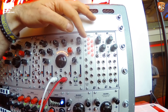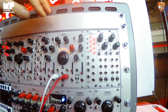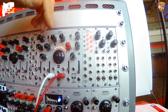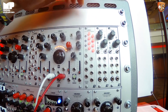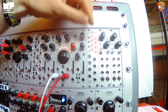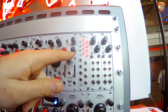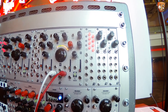These three knobs work as a comb filter — it's not a comb filter per se, because it works just on the harmonics. There's no digital delay line in there, just the original sine waves producing the sound. They are modulated in volume, so you can change the density of the bands of the filter, change the distribution of the bands with the warp, and with the peaking, change the width of the band.